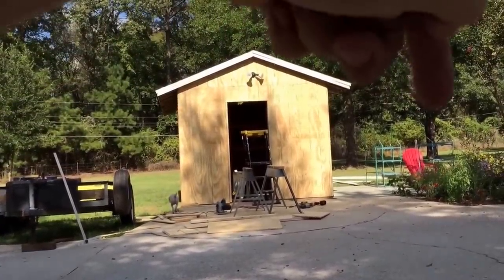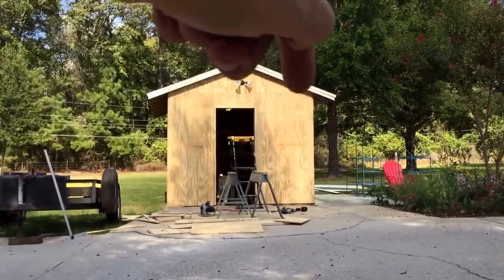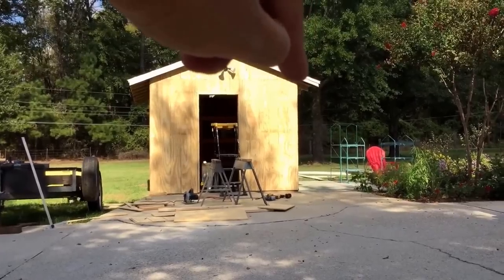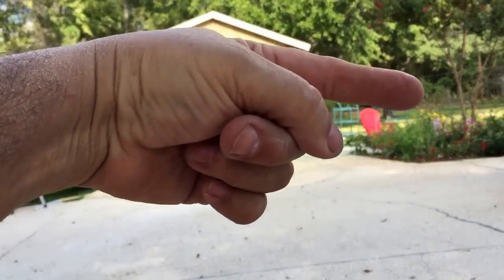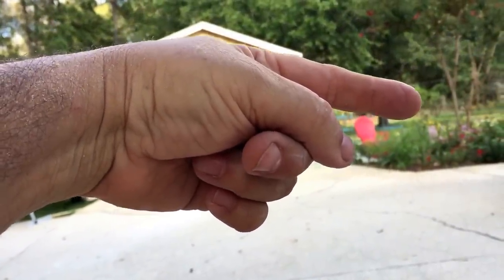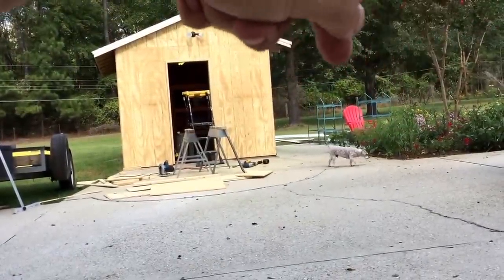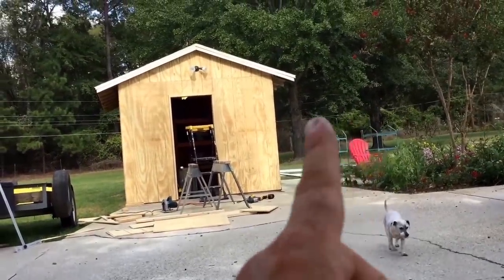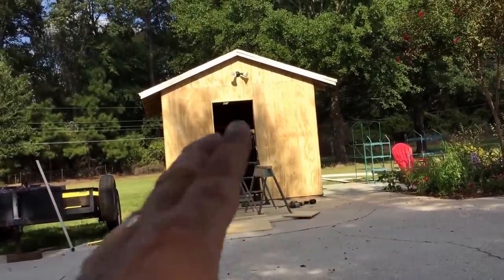I'm building a roof here to go out over the concrete, and I've got to lay my rafters on top of the top plate that these existing rafters are laying on. I'll probably cut flush all the way down the side of the building and come in with my rafters to lay on the top plate. Over here I'm going to have four-by-fours and a two-by-six going the length of the concrete, with rafters across the top. I won't do this side for a little while — the back side will be easy, no doors or windows.